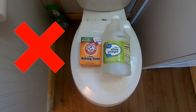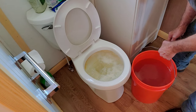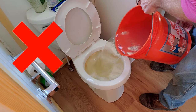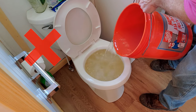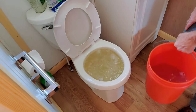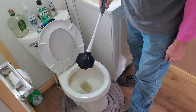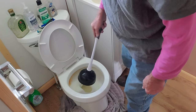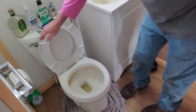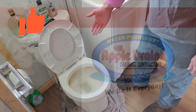A couple of quick notes. If you try a home remedy, especially this one, you'll probably have success — even though I showed that it didn't work. The reason for that is toilet paper dissolves all by itself in 20 to 30 minutes, and the waste and feces will usually become pliable and dissolve in about two hours. So you could pour this in there and wait, and it will probably drop. But let's take a look in our next video at how to properly unclog a toilet.